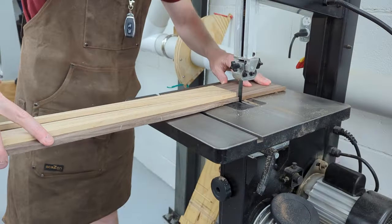In order for the entire blade of the katana to fit into the saya, I have to make cutouts for the habaki, since it is a little thicker than the blade itself. I start by marking approximately where I want the cutout to be, and then I slowly chisel away the material. The sycamore piece gets cut flush on both sides, and I mark the end of my cutout with a chisel.